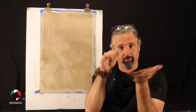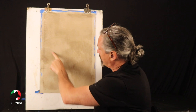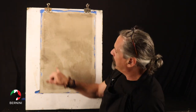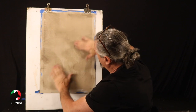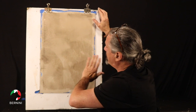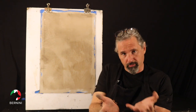Here's what I was talking about with the foundation — crooked foundation, crooked walls, crooked roof, and everything inside will be discombobulated. If you have a sloppy base with a lot of movement and texture, that's going to tell right through. See this movement? See this cloud? It's a little darker right here — more plaster, less plaster. These spots are thicker so they're drying quicker. When I trowel over it, the trowel rides on the high spots and fills in any low spots, leaving a thin layer of marmorino.